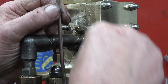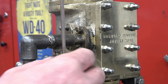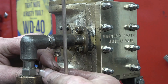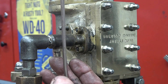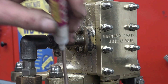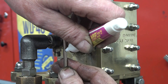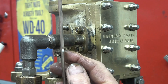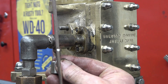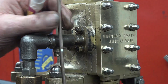We need to mark and cut this pipe now to fit into that olive. What I did was put a ball bearing in and you have to blank this off, then run it on compressed air to make sure that there is oil coming out. It needs to be cut about there because it does fit up inside — there's a little shoulder on there. It wants to be on this side of the white line.